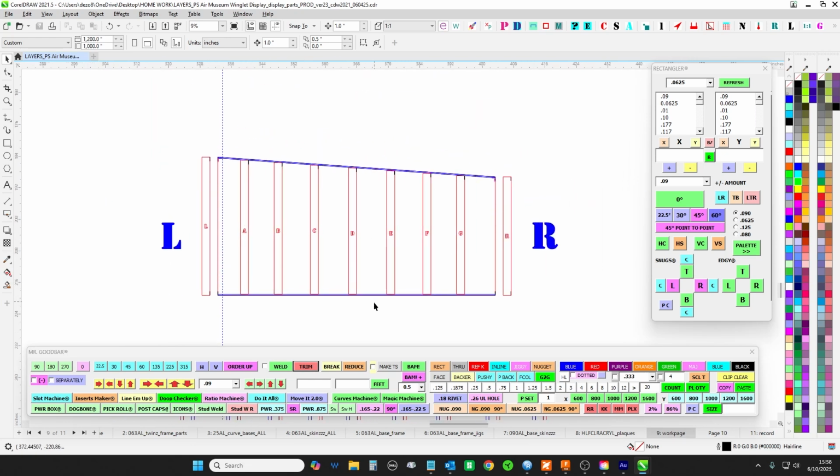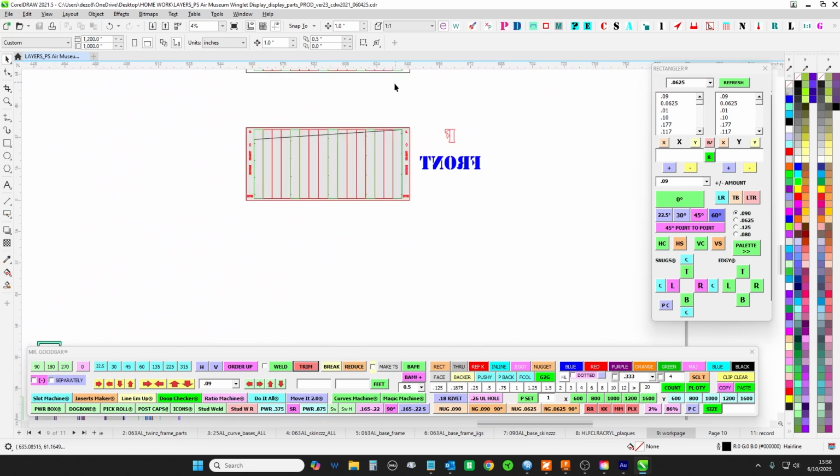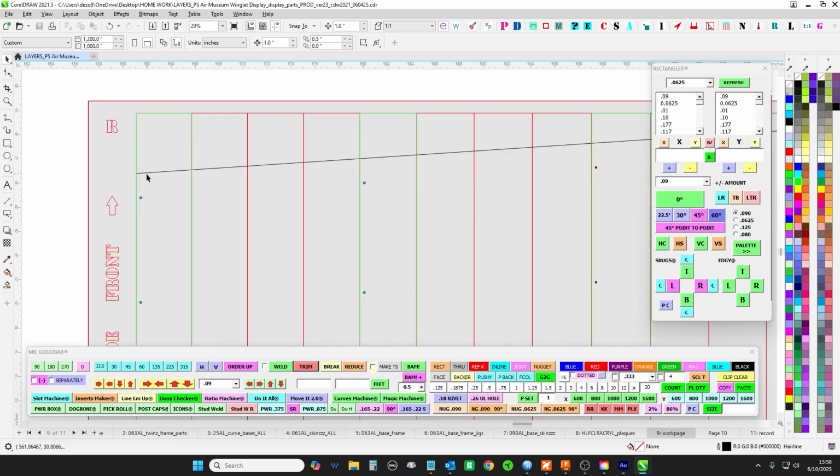And then I would suggest getting a cordless circ saw. Don't use a cutting blade, because a cutting wheel is too much heat, too much noise, too much everything. A jigsaw might work, but again, slow, heat, and also the up and down is pulling on the glue. I would let these cure overnight, and then you're going to come in with a small circ saw with a small kerf, and hit this as close as you dare. That way you take off as much as you can, and then you're going to trim route.